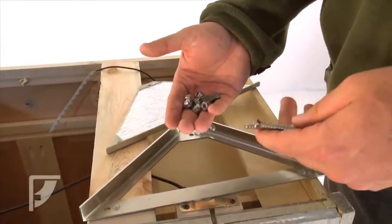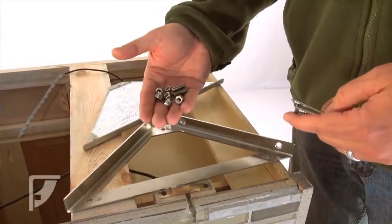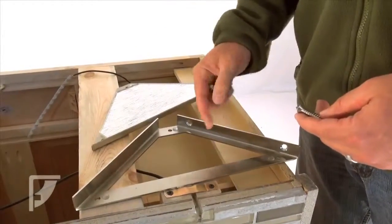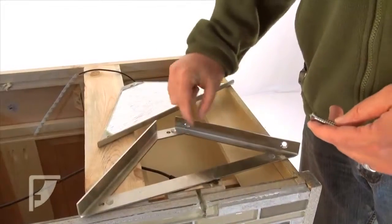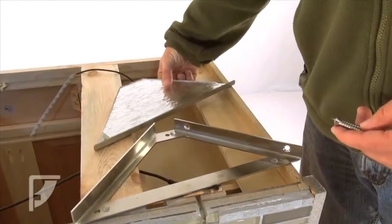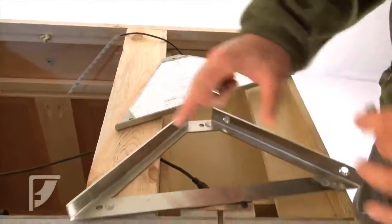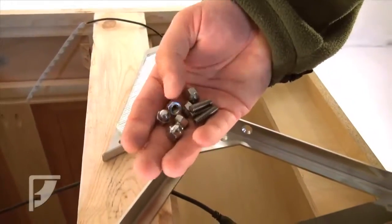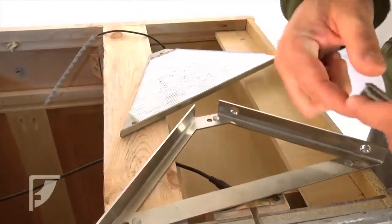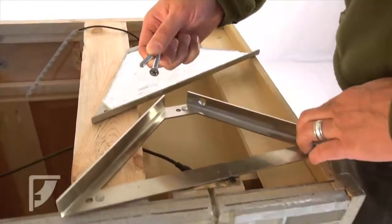So your Luminati lighted bracket kit will come with the fasteners as well as the parts of the bracket themselves. When you get to the installation part of this application, you're going to have essentially a base or housing bracket that has your support flanges on it. You'll have a piece of artisan insert glass that goes between, and you'll have a cover bracket that will pinch the glass between the two metal parts. You'll have fasteners that have acorn nuts on them that will allow you to tie the two metal parts together with the glass in between them. And then you'll also have fasteners that will tie in to your wall or your studs and tie this housing onto your application.